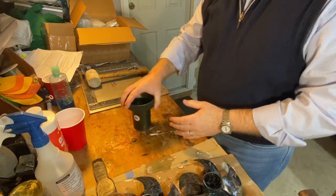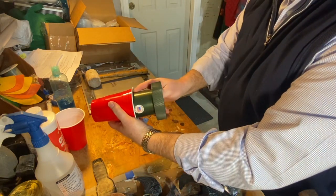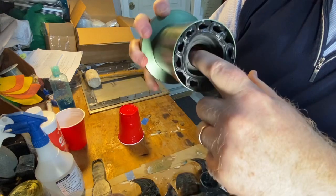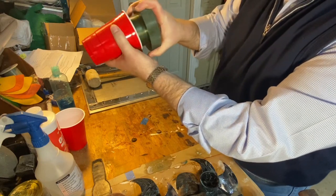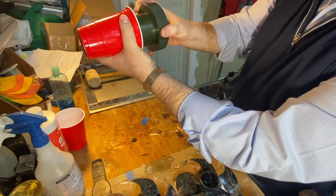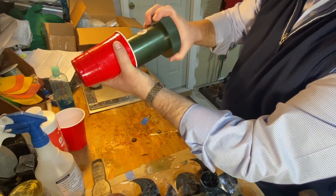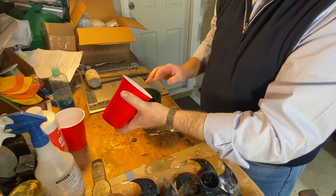Then you're going to take this and, if this is your pump body, you're going to push this in. This pump has splines, so it'll engage on the shaft of the pump. When you push it in it'll engage on the shaft and lock in place. Then you turn the impeller tool and as you're turning you'll pull it out. Combined with the locking on the shaft and the soap lubricant, the impeller will stay in there. You put on your replacement o-ring and your cover and you're good to go.